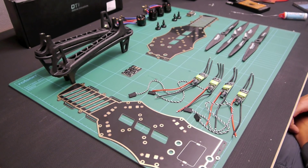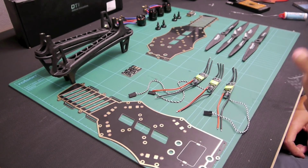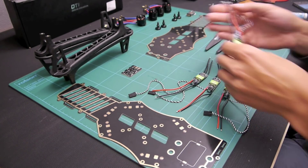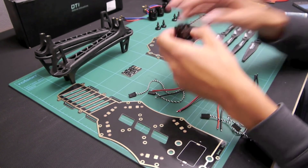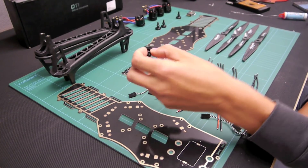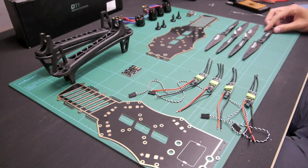As you can see, I've got the bits laid out on the table. We've obviously got the Diatone White Sheep frame, some RC Timer 30 amp BHeli ESCs - these don't have BECs in them so they're very small. We've got some Sunny Sky 2212s, 980kV. We've got the prop mounts, including counter-clockwise prop mounts so you don't have to worry about over-tightening your props, and some RC Timer 9x5 props - two of each.